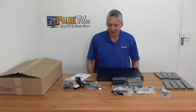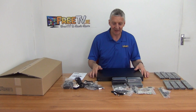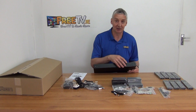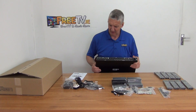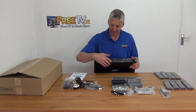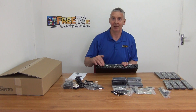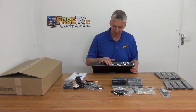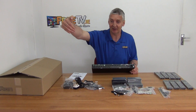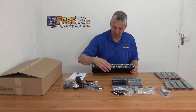The overall setup in this one isn't too bad. There's a matrix manual included, which is quite good. So basically what we have is we can choose any one of the eight inputs and match it off to any one of the eight outputs — you can select it manually on the front panel. If we come along with the eight inputs, for any one of the eight devices, we just connect the HDMI lead in. What we're imagining is a cabinet with this matrix mounted in it, with all the HDMI leads connected in. We'll number up each one so we know which is which, and the picture from each is in the matrix ready to be distributed out.